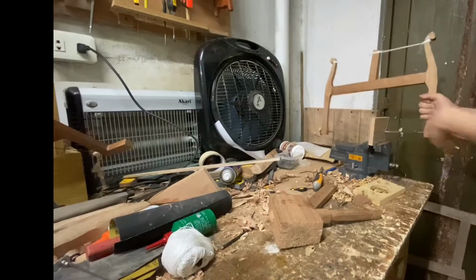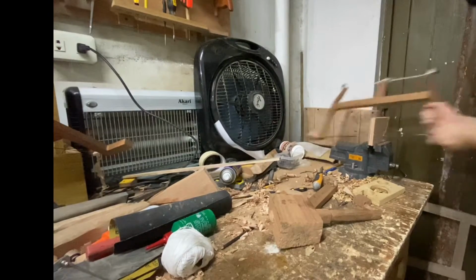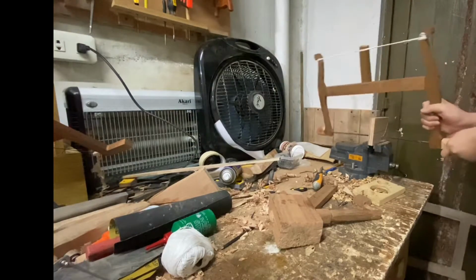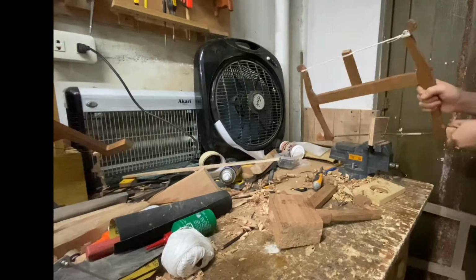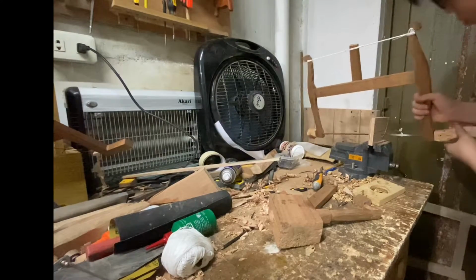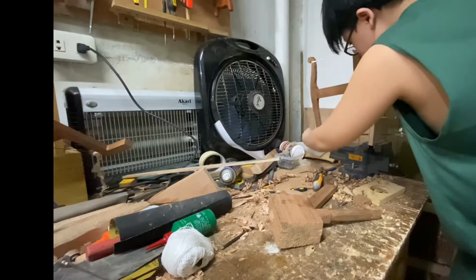And I think you can see that red dowel with sandpaper. And that's to round over not really the handle, because you don't really grip the handle that much, but the frame, you round it over so that it's comfortable to hold. I wasn't able to film myself rounding it over, but it's just simple. Just wrap sandpaper around the stick or a dowel and start to just sand the corners off.